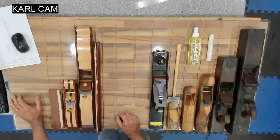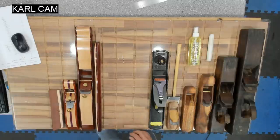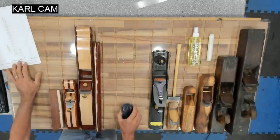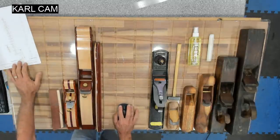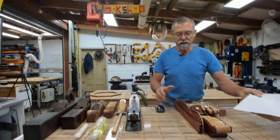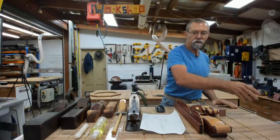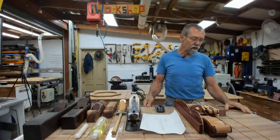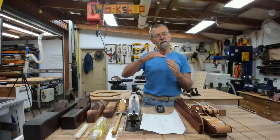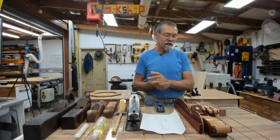Phil, Dave, do you think CNC could replace other tools like jointers or planers? Not really, Phil. It's one of those things. It's another tool. That's all it is. It replaces some things, but not everything. No. So I want to create some holes here for chisels to drop into. Now, I think I'll probably end up using the domino for that because I can set it up at an angle and it's going to have a nice wide mortise. That's probably the easiest way to do it.